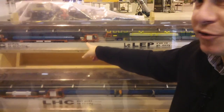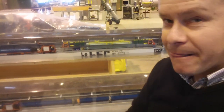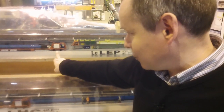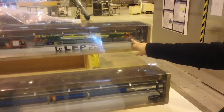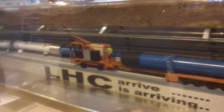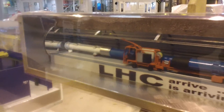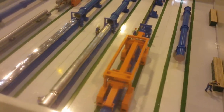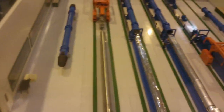There are little tracks for driving these many-ton magnets along the tunnel, with points where you can lower them down and drive them along the arc. The previous accelerator used a monorail to transport magnets around the tunnel, and the technicians travel on bicycles. About half of the 27-kilometer tunnel length consists of bending sections where you need dipole magnets placed one behind the other, so roughly half the tunnel is basically covered by the blue dipole magnets.